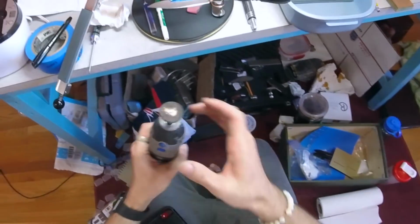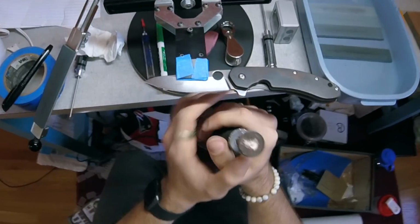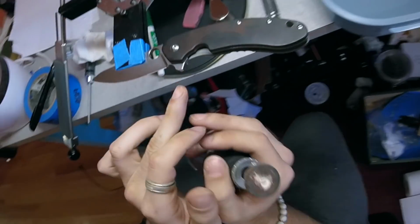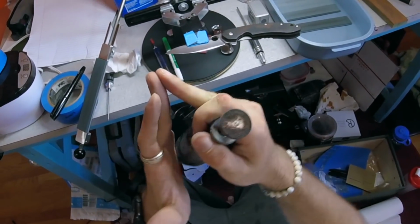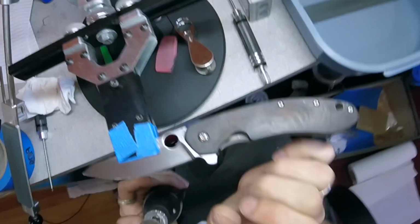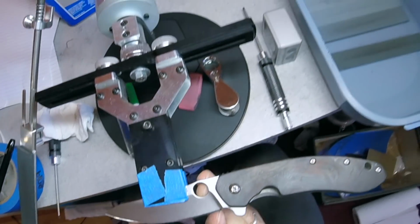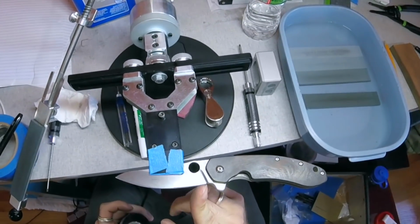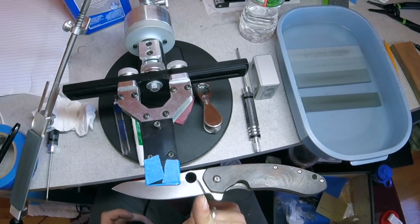And very carefully, hold your knife, or even put it in the clamp, and then increase that choil until it's past the area of metal that hasn't been brought to a flat point. With this one, it would be about right where my fingernail is there. If I brought that choil out to that fingernail right there, I wouldn't have any issues. Okay.